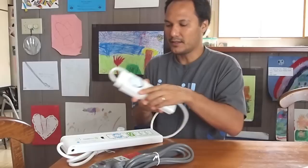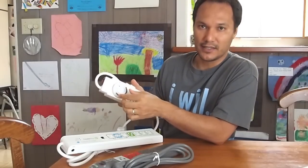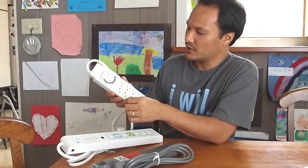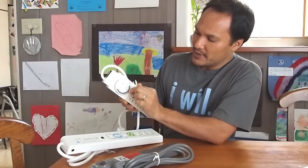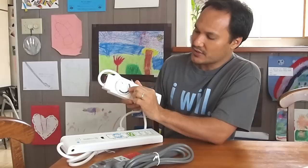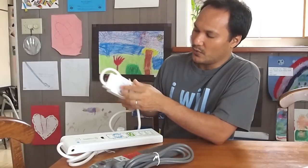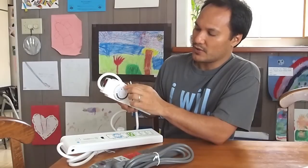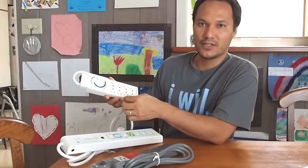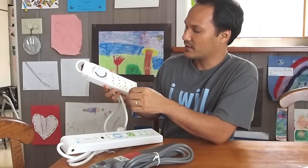The timer strip works a little differently. This one is mechanical — you can also get electronic ones. I haven't found these locally, so I bought this on eBay for about 10 to 12 dollars with shipping. Like a hot water timer, up is on and down is off, so you just set on and off times during the periods you want. You can cycle something on and off at various points throughout the day. It's perfect for a Wi-Fi device that you want to turn off for 16 hours a day — you just set the times you don't need it and it takes care of itself.